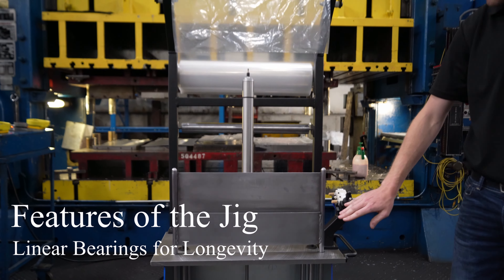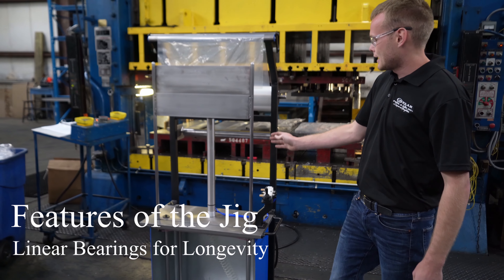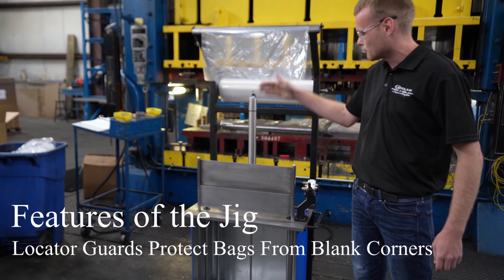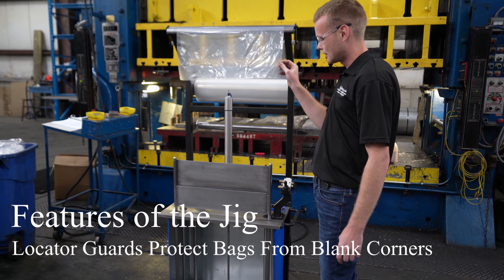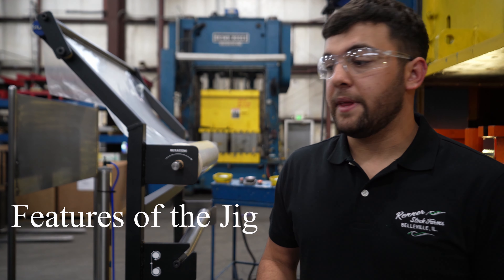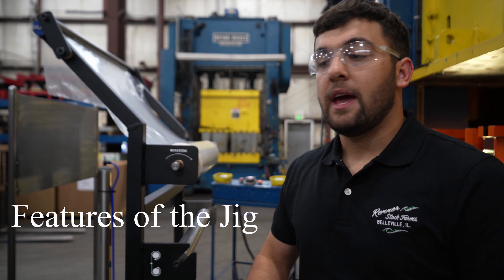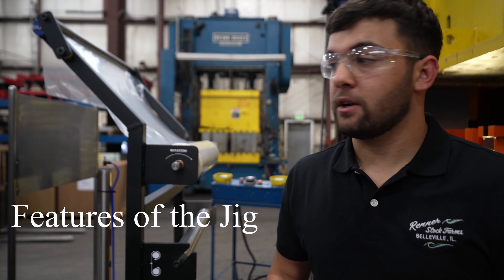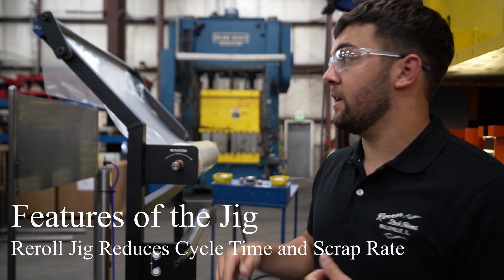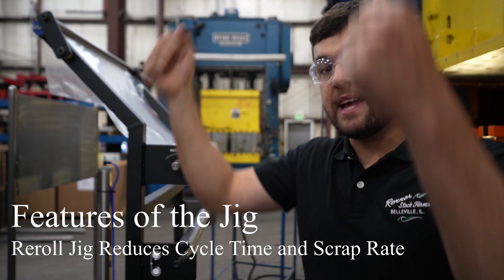That is what drives this assembly up and down. On top of that, we have locator guards — this is what the sheet metal blank will sit inside, and they protect the bag from the corners of the sheet metal blank. As you saw in the prior video, the operator had to reach down below, rip off the bag, open it up, flip it over the jig — resulting in a lot of ripped bags and lost time. So we incorporated a re-roll jig that flips the bags around so the open end faces out, allowing the operator to pull the bag over the jig and down over the blank — faster and with fewer ripped bags.